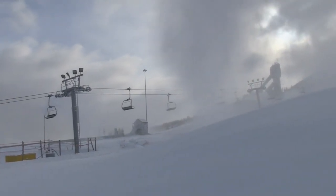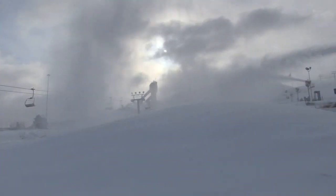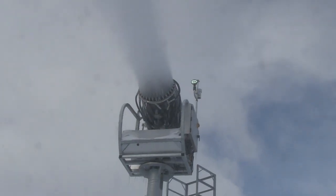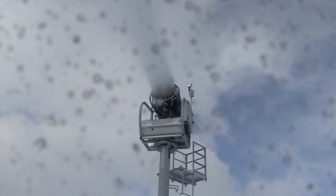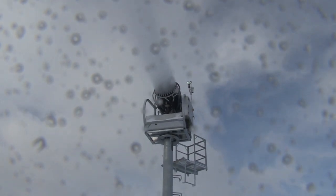What's the optimal snow-making temperature to do this? We can start making snow at about minus 2, but we need a lot of air to dry that snow out and make the water particles really, really small. About minus 10 to minus 15 is perfect snow-making weather because we don't have to use air and it saves money on power. Anything colder than that, we just make twice as much snow.